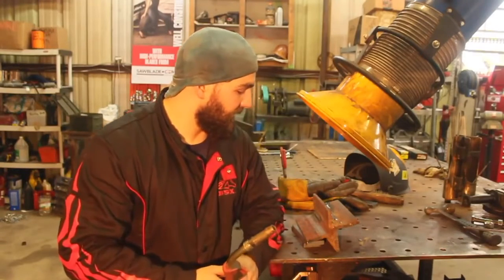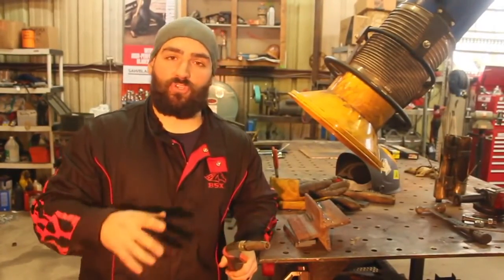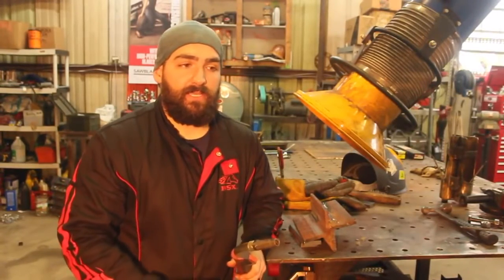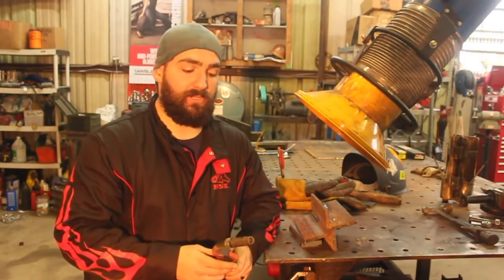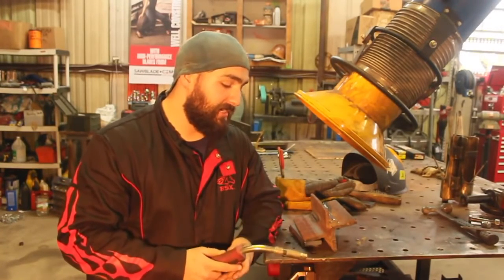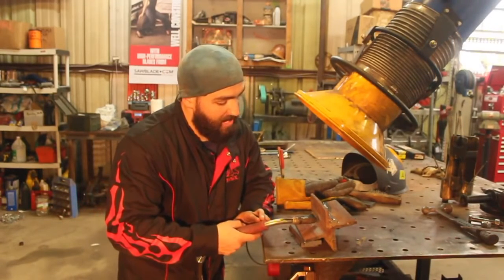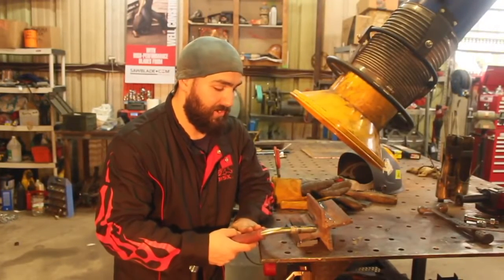And then a couple other things I wanted to talk about is your gun angle. You're going to hear a lot of guys tell you push, pull, drag, up, down, whatever, it doesn't matter. And in some cases, you're not going to have the choice whether you can push or pull. You're just going to have to do what you can do. But I will tell you that the best way to run flux is at a slight 15-degree drag. So if you'll see, as I run, I'm always kind of dragging and pushing with my fingers. This is not pushing, this is dragging.